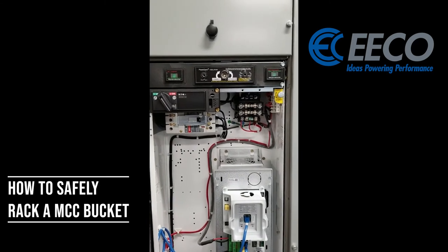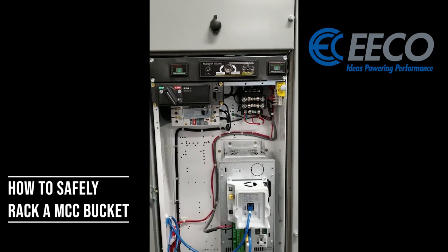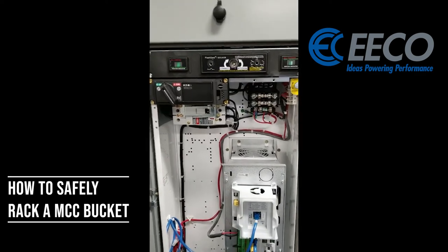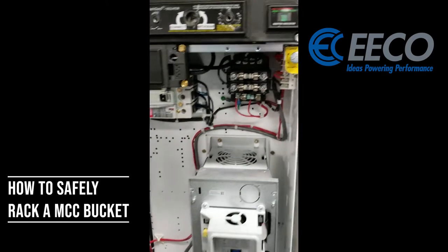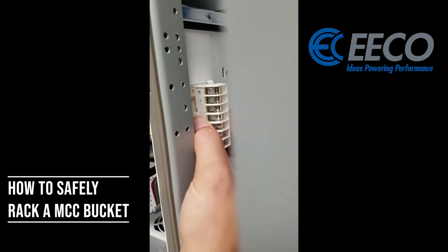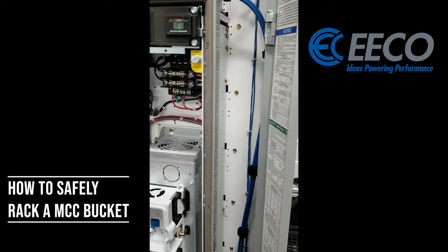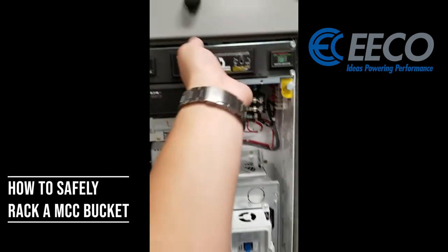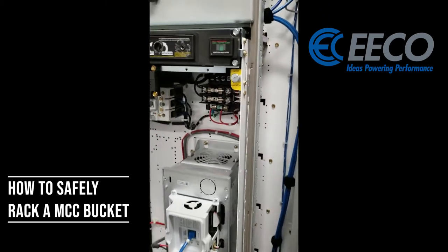Some of the smaller buckets are easy to do, but with these larger buckets like this you probably want a two-man operation. This large drive is actually on a rail system. One other thing we need to do is open up the side wireway here — we've got terminal blocks there if we had them connected to anything on the inside of our drive. Those need to be removed before I remove my drive, and you'll see there's just a quick release where I can pull these out like that. Those are now out. If they're wired, you just let them lay in there. Now this is disconnected so I can actually go ahead and pull it out on the slide.